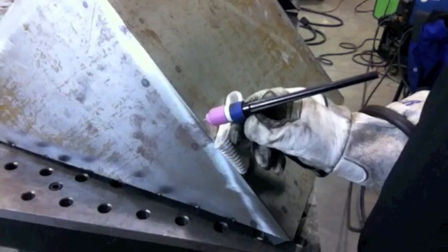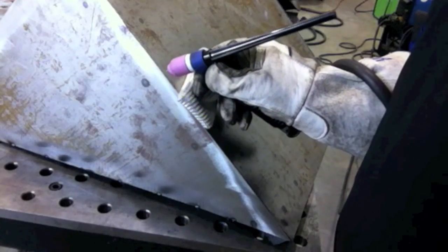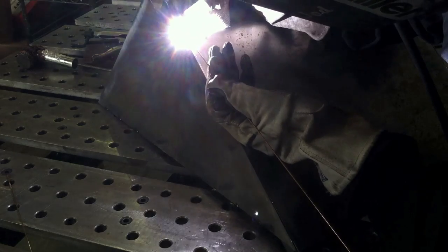You can flop it around in all kinds of different positions and it slides nicely along the joint, letting you go a long way — a handy little tool for propping where there is no prop. Going downhill like this, trying to keep a pretty tight arc, about 55 to 65 amps in that range somewhere. I'm using a foot pedal, so some of these joints have angle iron behind them and some don't, so it takes a little bit of different heat.